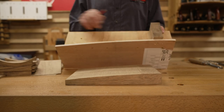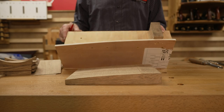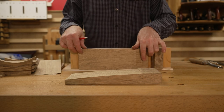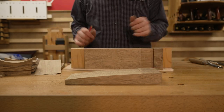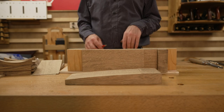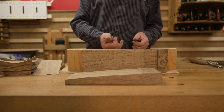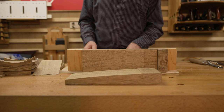All right, so that plywood former, we've got our edge shape to the curve. We want it longer than you need. So when that's dropped in, that follows the two little fingers on the bandsaw that we screwed onto that circle cut jig. Real good way of working and safer to do. Single one-grip clamp, good to do because you can undo it easily without having to twist anything.